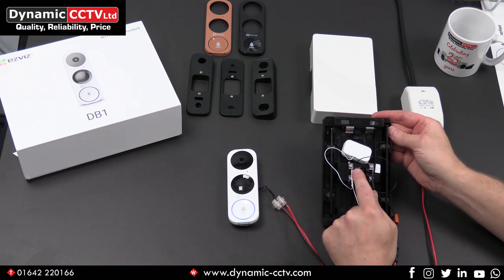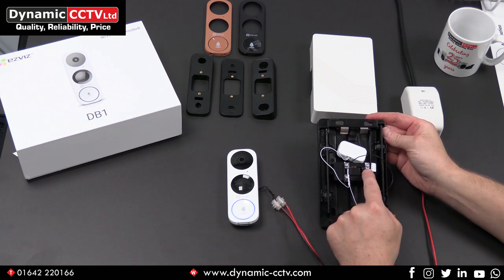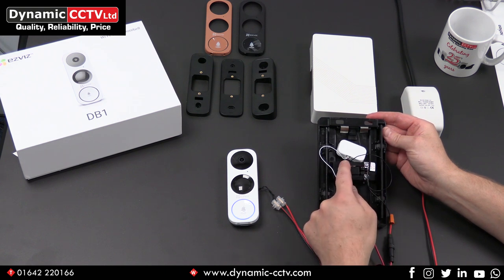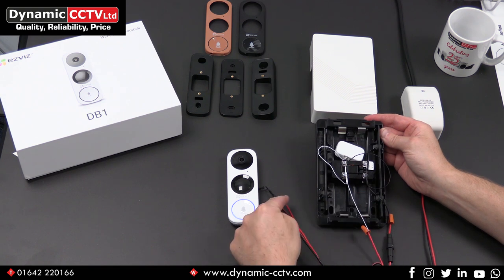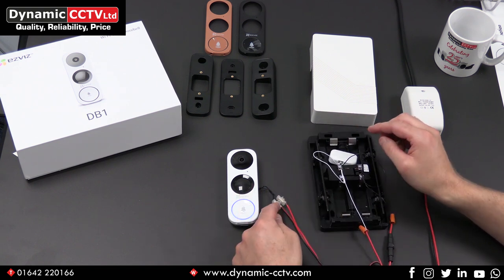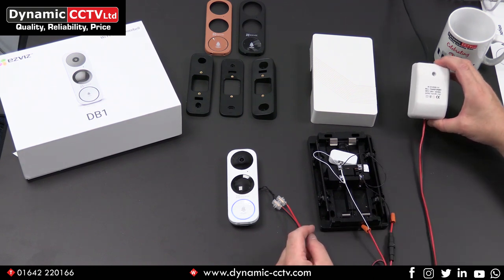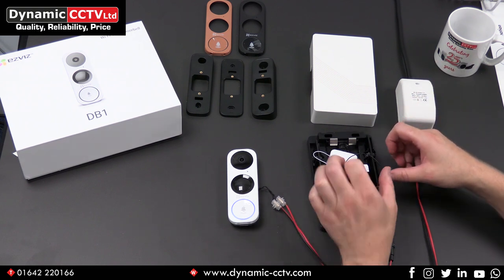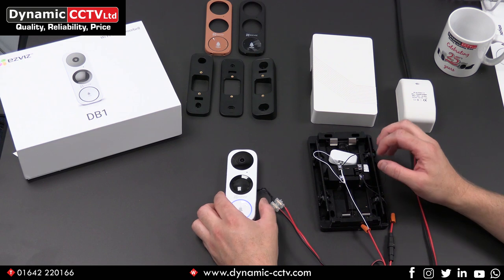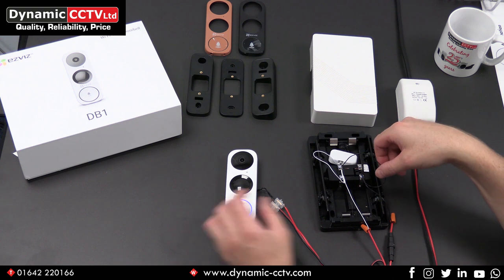We're then running the second feed from the fuse into the solenoid of the mechanical chime. The solenoid runs across terminals two and three within the DC1 WH. We're coming out of the fuse into terminal three into the solenoid at one end, then out of terminal two at the other end of the solenoid and on into the doorbell. The secondary power feed from the doorbell is fed all the way back to the ground on the 12 volt tap of the secondary winding of the transformer. Basically, the solenoid is wired in series with the doorbell.